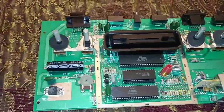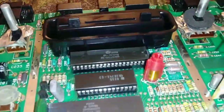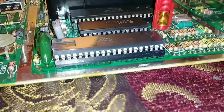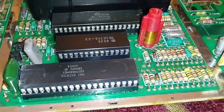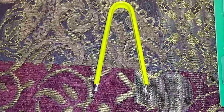What we're looking at is this chip here, closest to the cartridge slot — that's your RIOT chip. Below it is the RAM; the RAM can also go bad. On this model, the four-switch woody and the older ones, there are sockets so the chips just pop in, which makes it very easy. If you have a Vader console, you have to desolder the chip from the board — it's not difficult, but it makes this a lot harder.